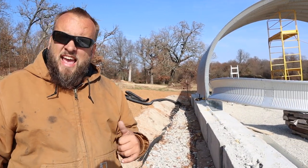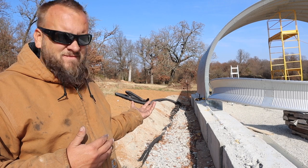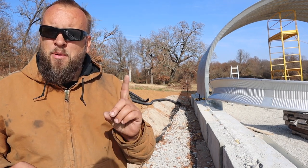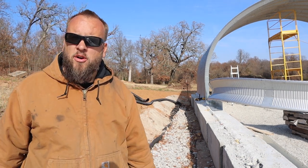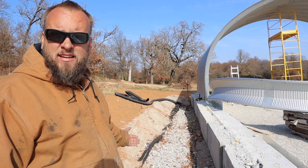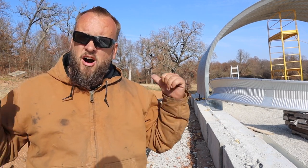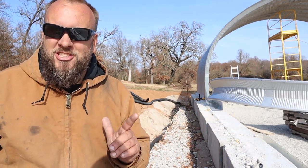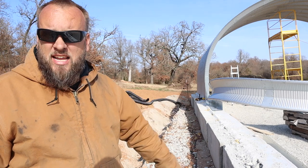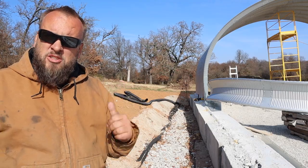Hey, it's Brock here from Rock Hill Farms. You know that old saying that when life gives you lemons, you dig a drain line? I don't know if there's a saying like that, but there should be — because however many drain lines you have, you could probably use one more. Things aren't always going to go according to plan, so we're gonna dig a line extending this drain line right behind me down the hill, connect it to the drain line we have up the hill, and see if we can get water to shed off from around this building. I'd rather be standing up arches on the Quonset hut, but there's just as much work to be done around the building, so I'm gonna get the backhoe on the tractor and get to work.